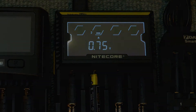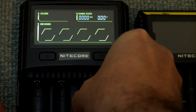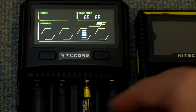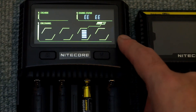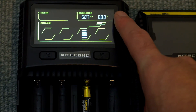I'll show you on the newer SC4 from Nitecore. This one has a manual battery activation feature. We put this cell in — we already know that the voltage is below one volt, 0.75 — and the error message comes up. What you need to do with this is just push both buttons at the same time, and that will tell the charger to put current into that particular cell, overriding the automatic charging.